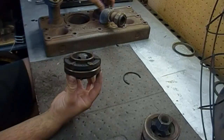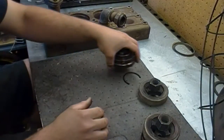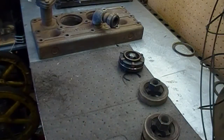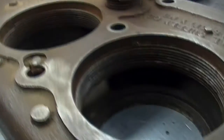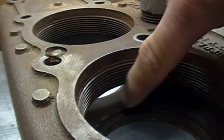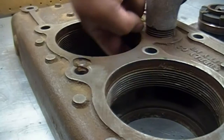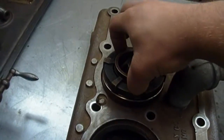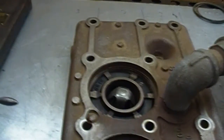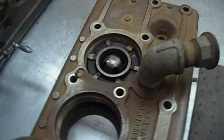It's all retained by that cap there, which threads right into the top. There's a copper gasket and another gasket up here just so that the air is separated. We'll show you inside the head where the reliefs are cut for the air passage. You can see right inside here is the outlet to this pipe, and the same over here — that's the outlet going up to the tank. The valve cartridge — this is number three — sits right in there like that with the cap. Simple as that.